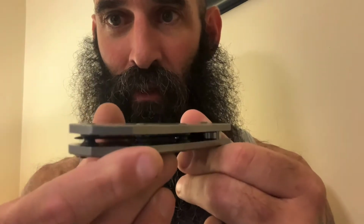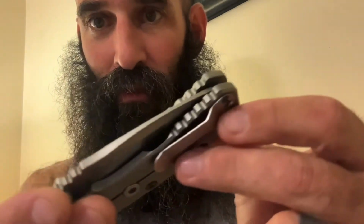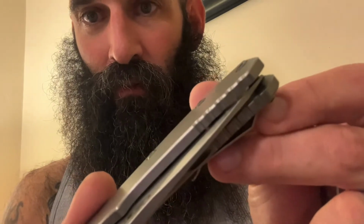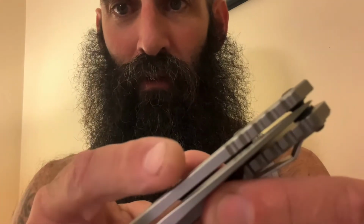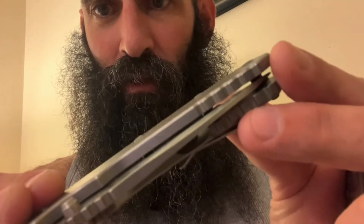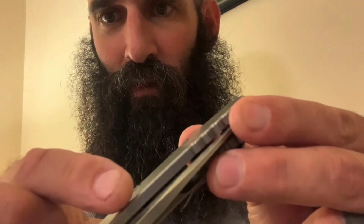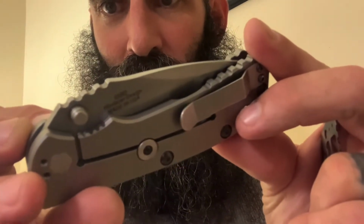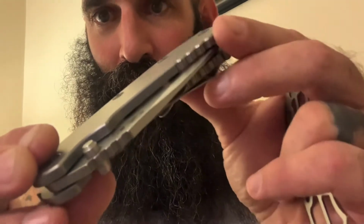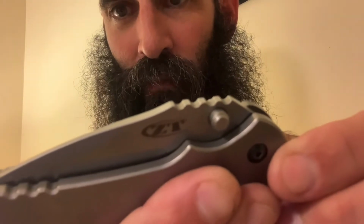As a machinist, after you finish a product or make a part, you always figure out ways you can make it better or easier the next go around. So for me, the two things I've seen on this, and I'll get into more detail, start with the chamfer. If you don't know, it's this 45-degree bevel. On mine, it's just a hair smaller than theirs on that side. You can see how big it is right there. It's just a little bit smaller, maybe ten thousandths or something.